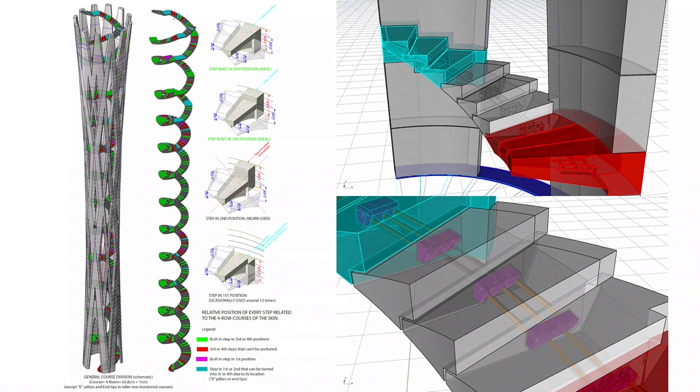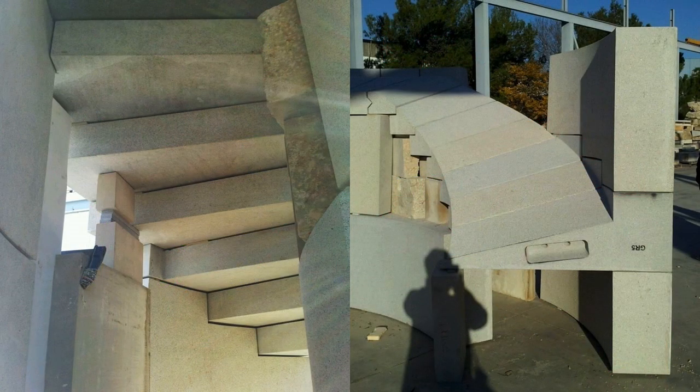That's quite a challenge, particularly because there are a lot of big openings in that stone core, and therefore we have to cantilever a stair from nothing as it passes the windows. So again we're post-tensioning the stair with steel rods inside the staircase to keep it connected together as it cantilevers off nothing. We're at the proof of concept stage. Interestingly, the first assembly of the stair is upside down — it was just easier to support it off the flat surfaces than off the continuously curving surface. They're about to put the rods in and post-tension it.